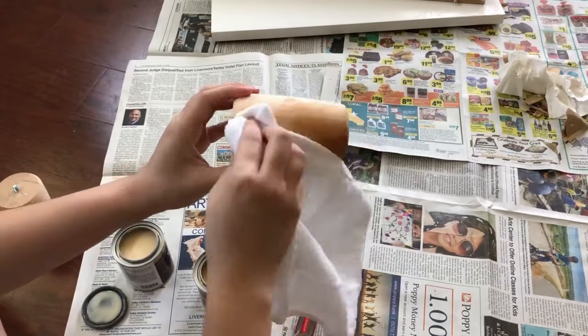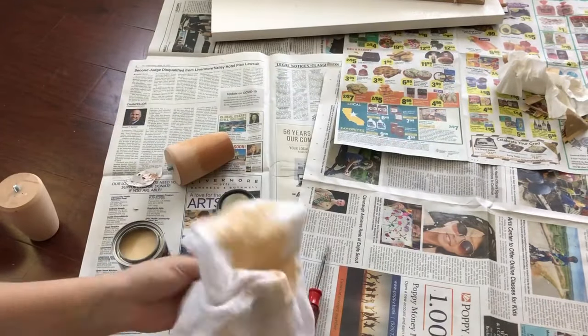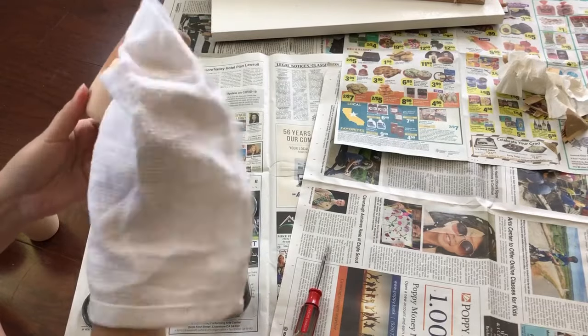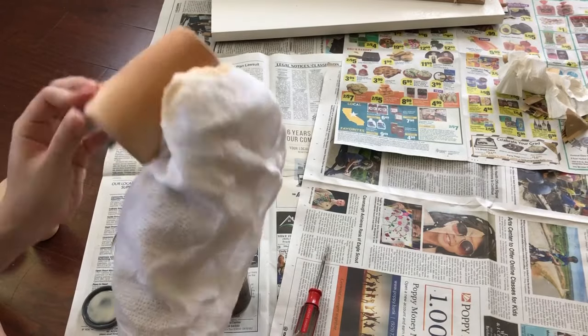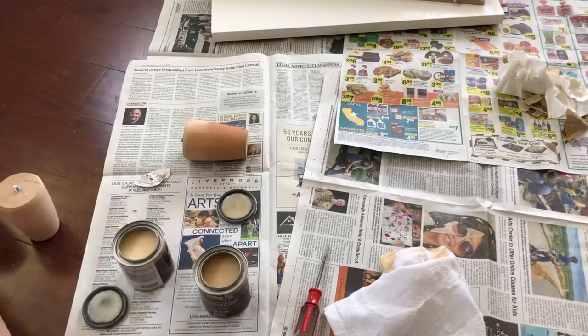as the drawer colors. So I picked up a couple of different stainer and sealer combination colors, and both of them are actually a little bit too light, but what you can do in that situation when you want it to be a little bit darker is to add in a couple more coats of stain. So I'm going to go ahead and do that and see how the color compares.